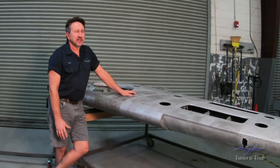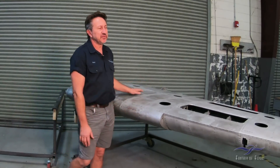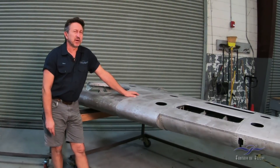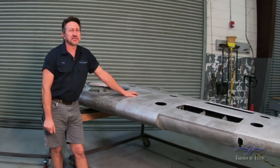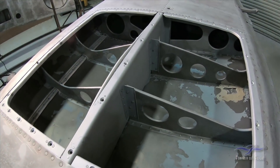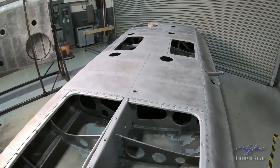It was worth the effort because I think it was a lot easier on the airframe itself. The rest of it came off pretty clean — no big surprises, a few skins here and there that have to be replaced. A lot of the skins have little minor imperfections in them. Still there were sections of this wing where the paint and filler actually chipped off in a few places, and I miked them — it was upwards between 60 to 80 thousandths of filler in some areas, which is just crazy. But it's all off now.